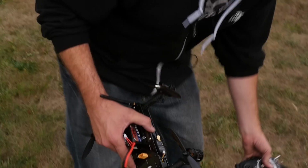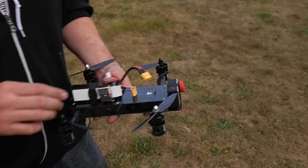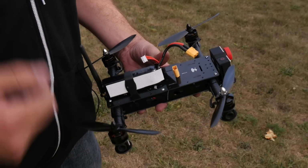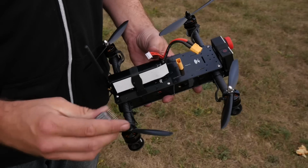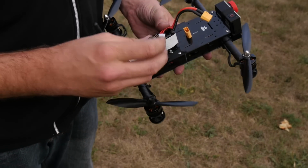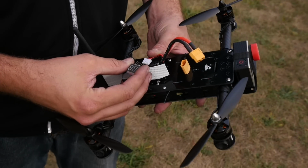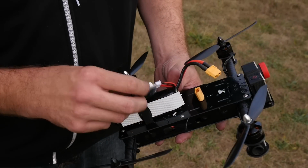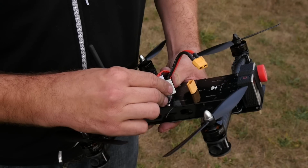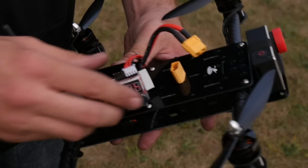The other thing I want to show you is with multi-rotors, it's really important to monitor your battery voltage. Oftentimes you're having so much fun you get lost. Don't be like me and puff batteries. Use a little voltage alarm here. This is a simple little $5 one we got in our store. And plug that in. And what I do is I got prickly Velcro here, I got fuzzy Velcro here. I just stick it right on the battery. That way it's not flopping around.